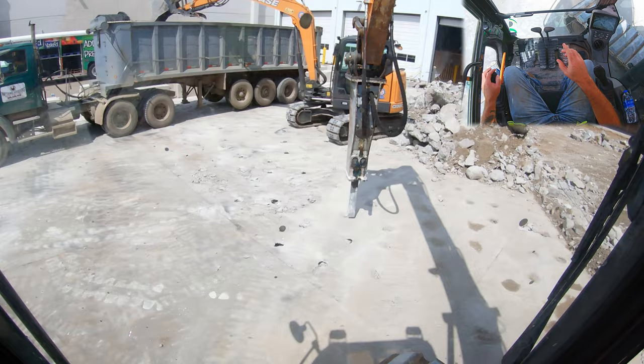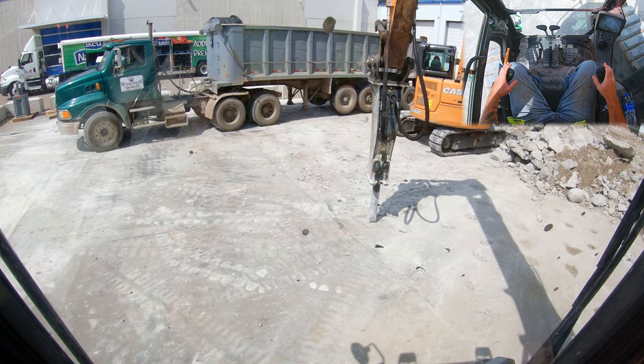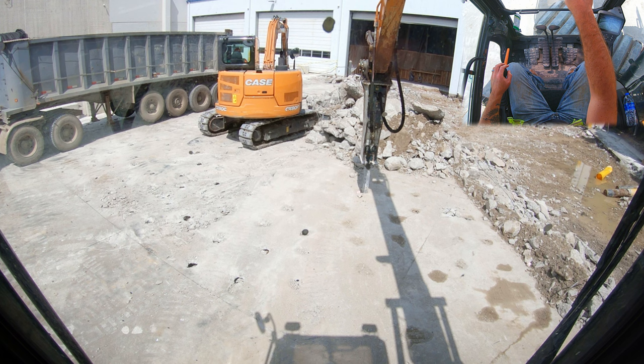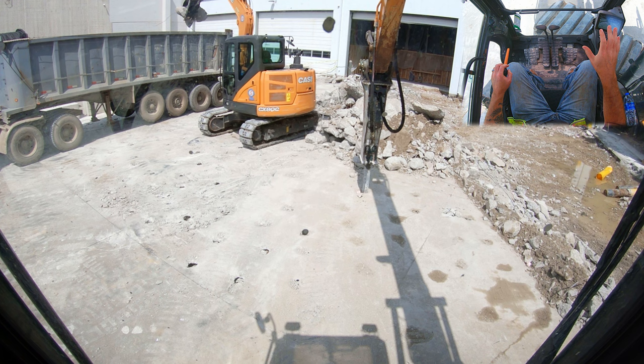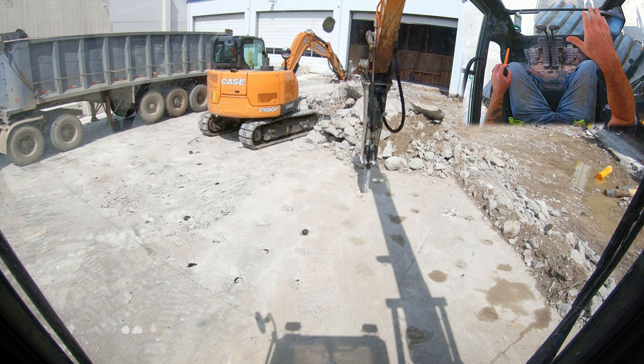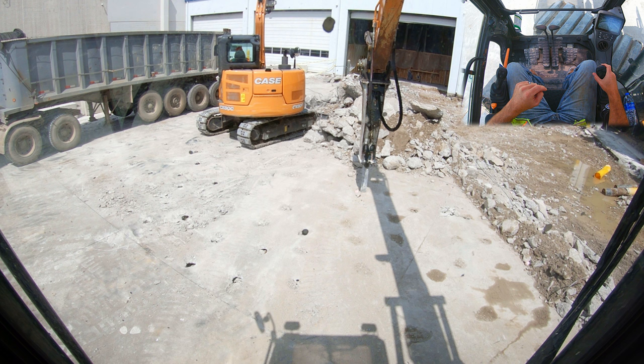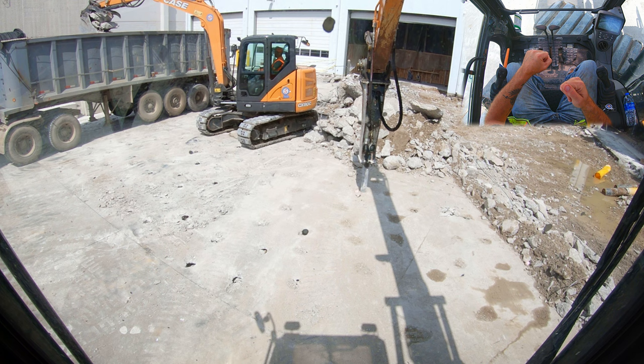Over here is what I've been breaking since I know how hard everything is, so we're gonna pop a couple extra holes in here for Rick and help him out. The first thing we're gonna do when we set up — what I'm looking at is my top cap, which we talked about in our setup video. The top cap is essentially the very top part attached to our pins. That is level for the hammer, and so if we get this thing situated right about there, I'm level and I've got full downforce from the machine going to that hammer.